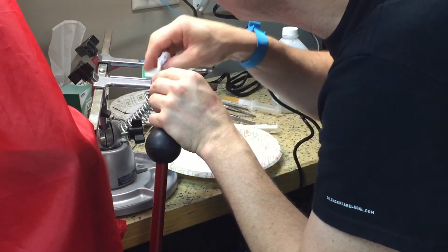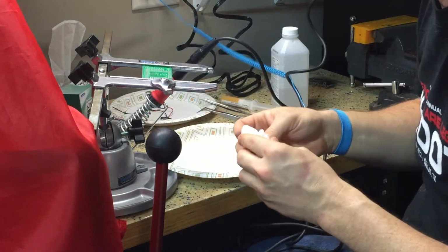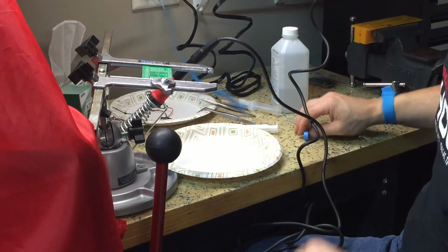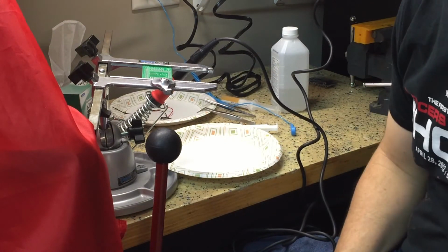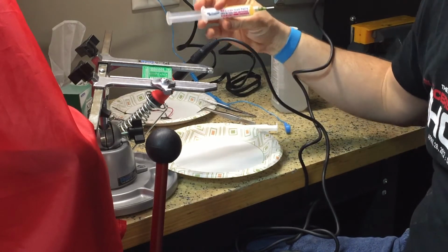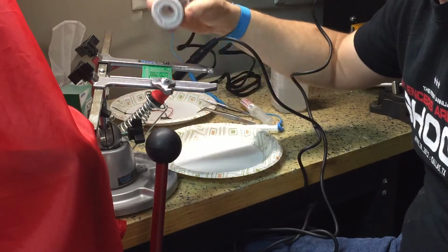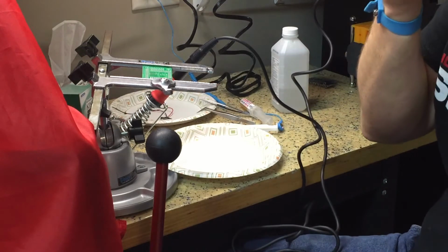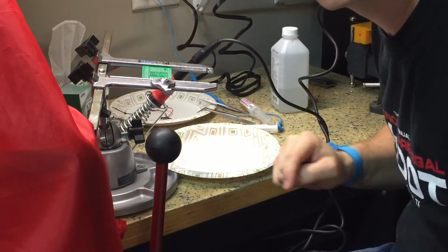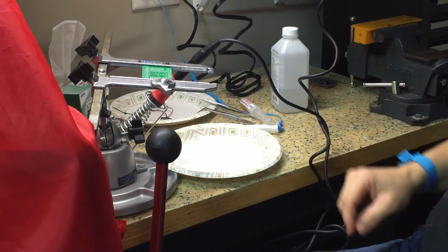Alright, so I'm going to zoom you in here because while we were doing the resistors, I was thinking that it would be nice to try a little bit different technique on the IC. I did buy some flux, which other people were using, just a bead of flux across here, and then using some solder to get those down. So I do think after having done these, I would not be able to get solder paste onto the little pads there.